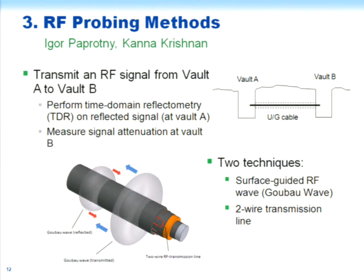So here again is our piece of cable, and the idea is to launch this RF surface wave, first analyzed and experimented with by Georg Goubau. So what we want to do then is to launch this wave, most of whose energy is outside the cable. And its energy is very concentrated. It's guided by the cable, but its energy spreads out quite a distance from the cable. As a result of that spread, where most of the energy is located in the air, let's say, around the cable, this has very low loss per unit length.